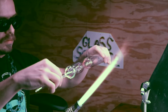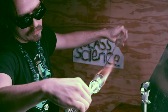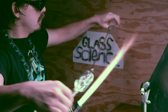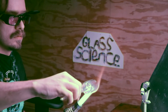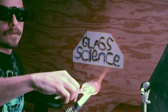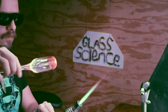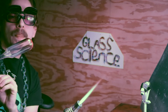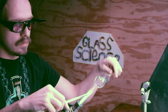Now the second point, as you can see, is quite off-center, especially in the left hand — I wasn't rotating as I should have. But that's okay, I don't really need a handle on this other end right now. To fix the blow tube and make sure it's on axis with the other tubing, you just heat up the shoulder where it connects and rotate it, and that will help you get it straight. Now this tubing is going to fit into the large vessel made in part one of this episode. I'm going to shrink it up a little bit and flare the edge before I fit it in.